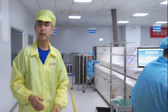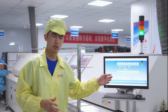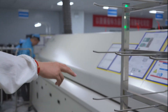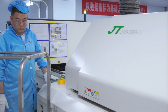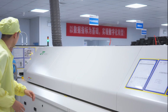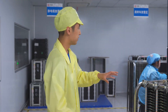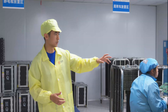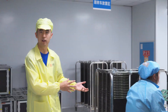You arrive here at the reflow oven. This reflow oven has a lot of different temperature zones, which are for the different stages of the particular solder paste that's selected for the reflow process. It goes through this long, long chain of heating and cooling — as you can see, this one probably follows this heating curve. Once this heating curve is followed, it gets cooled off and comes out assembled onto this rack here. Some boards are then passed onto the AOI that is done post-assembly, as well as a human inspection that is done right here.